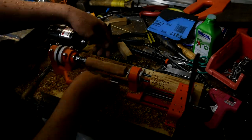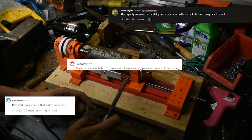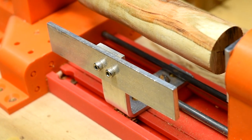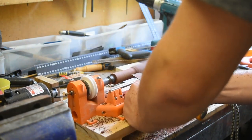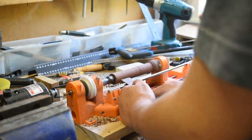To finish up this overview, the one new feature of this version: the adjustable tool rest. This was, apart from being told to clamp the whole setup down, the most common feedback I received on the previous versions — and it's here now. Not height adjustable unfortunately, but it can move in and out to be closer to the workpiece. The old tool rest was just a rod that ran the length of the lathe and could not be adjusted.